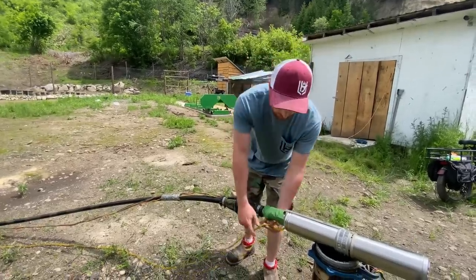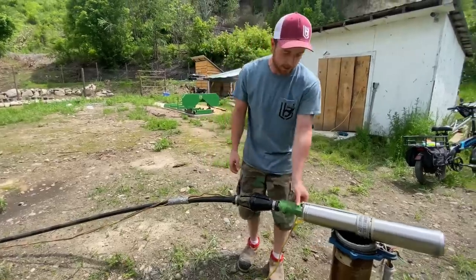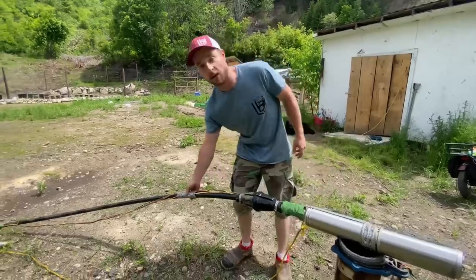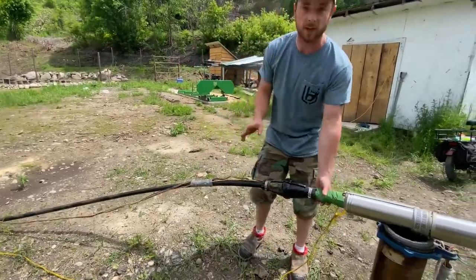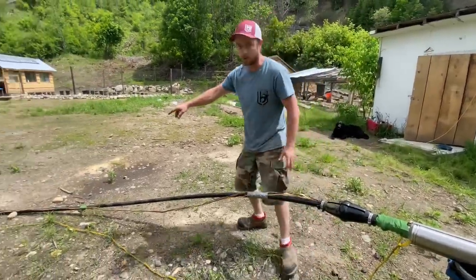As you can see, we have our yellow rope, which we're gonna be replacing with the cable. That's attached over here to just an eyelet as a safety point. And then our wire comes out, and there is this special well tape that you wanna use if you're doing this. You can see we ran out and used duct tape. The duct tape did seem to last, but as far as adhesiveness, this green tape is the way to go. And then this wire just runs all the way up the length of the pipe.